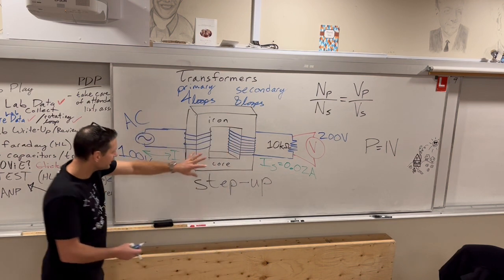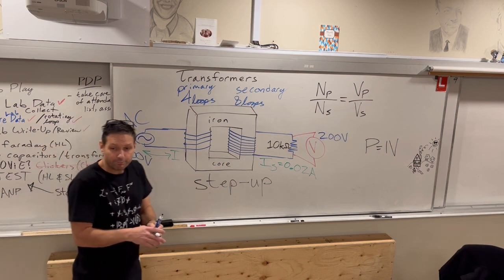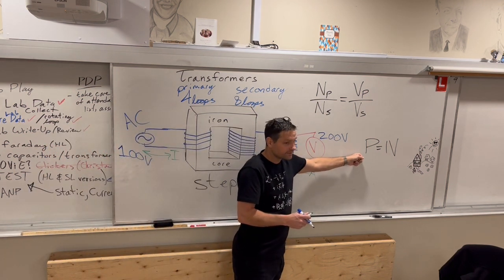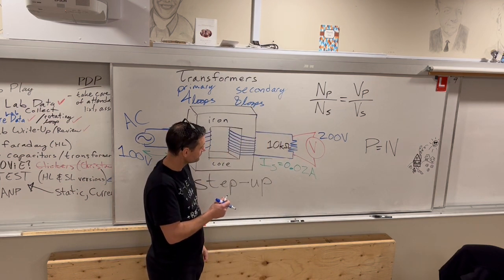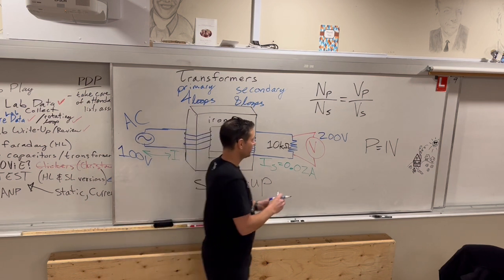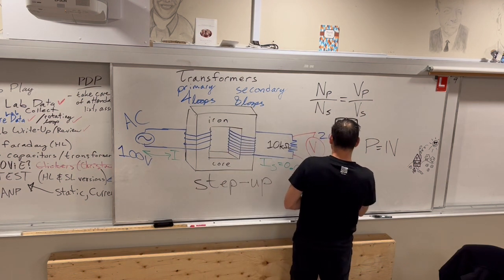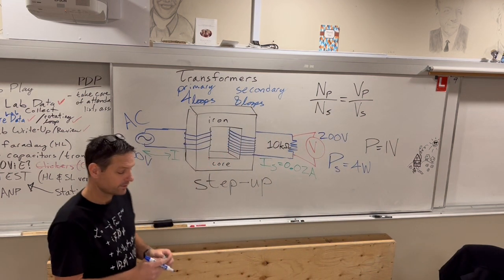And now let's bring that over here. If you think in terms of power, what is my power here in the secondary loop? It's going to be 4. 200 volts times 0.02 amps. So my power in my secondary loop is 4 watts, right? So 4 over 200 equals...